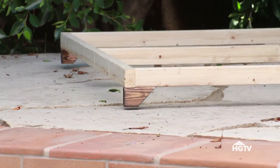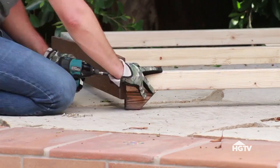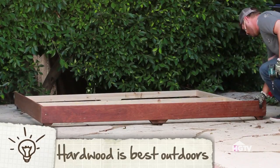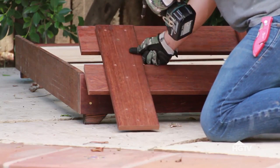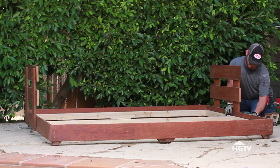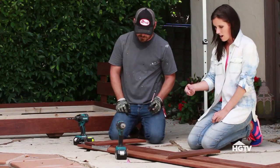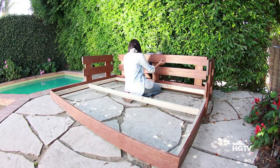Now that we've got a frame, I'm going to make it look good. Cutting some 1x6 mahogany decking to go in the sides of the bed — two pieces at 62 inches and two pieces at 83 inches. Now we're going to construct some armrests for our daybed with two vertical mahogany pieces at 21 inches and two horizontal pieces at 31 inches. It's always good to kick back, so we're going to make a backrest too, constructed the same way as the sides.